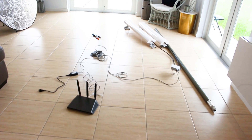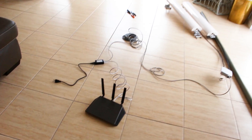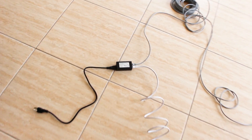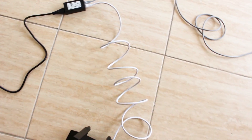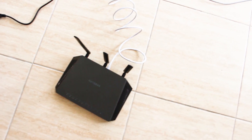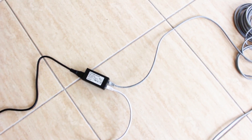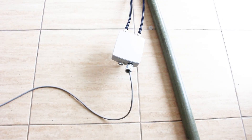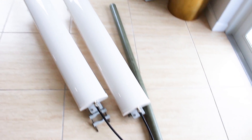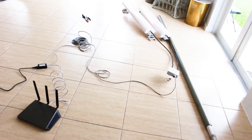It's so hot outside, so I decided to do the pole mounts indoors and then take it all out and slide it onto the tripod. Just to go over the connections one more time: there's the POE with two ethernet cables coming out of it and another one for power. One ethernet cable runs to my router — that's what gives internet to the whole system via the LAN port on the POE. Then the POE port is where the long ethernet cable runs all the way up to the access point. The access point then has two coax connections which connect to your antennas. That is how internet travels from inside your house to outside on your Wi-Fi base station.